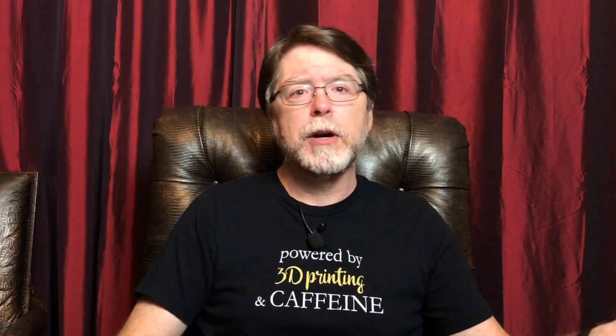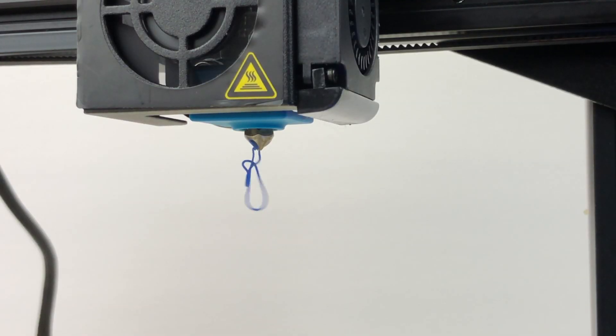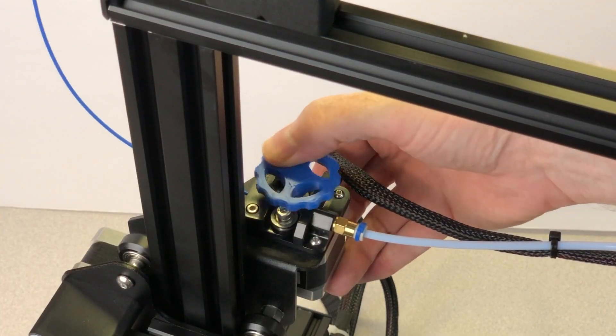But once you've got the filament going down into the nozzle, especially if you're trying to purge one color out before using a new color, you'll appreciate being able to turn this knob to do that. You won't be able to turn it when the stepper motor is energized, but most of the time when the printer isn't actively printing, the motors aren't powered up — that's why you can push the bed back and forth and move the X carriage left and right. So heat your nozzle, pull out your old filament, push in your new filament, and turn the knob to purge it out. Super easy. This one in particular by Thingiverse user Stimpy has a little divot for your finger so you can spin it fairly quickly. But if you don't care for the look of this one, just search on Thingiverse for extruder knob and marvel at the astonishing variety of them. Then pick one you like and print it out.